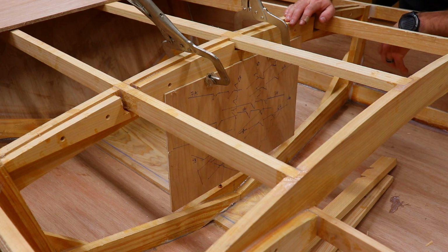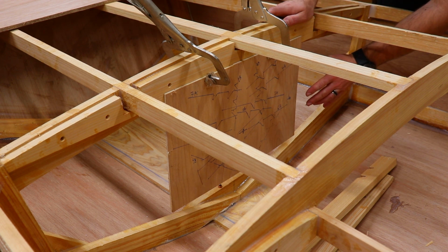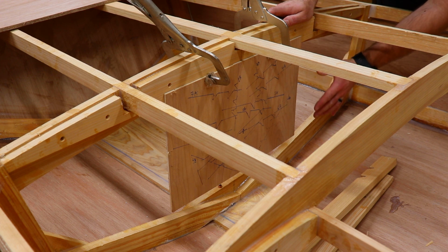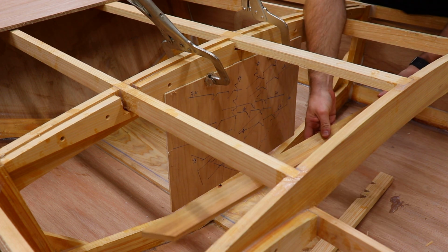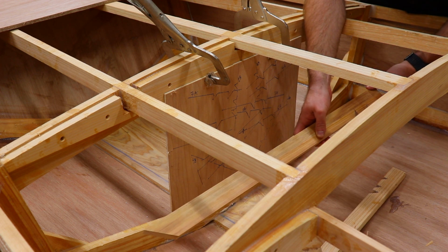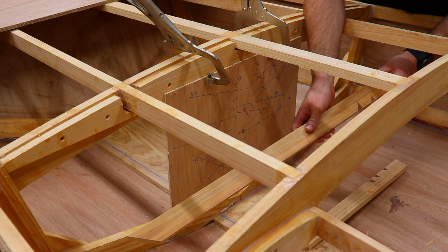I'm also working on making a bulkhead for the number 5 frame to waterproof the aft compartment of the boat for buoyancy. I'm using a method called flagging off, or using tick sticks. This method is great for transferring odd shapes over to another piece of material to make a pattern or your final item. I've made 2 tick sticks, one long one and one short one because of the confined space, and they need to have some sort of notches or shape that makes the end of the stick unique.